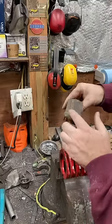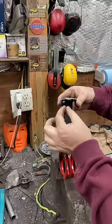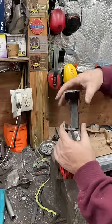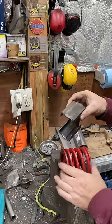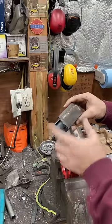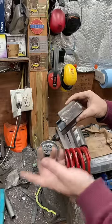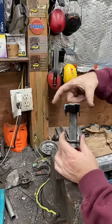There's a weld along here, along here, and along here. So when the spring is compressed, the spring is pushing outward in this direction — on both sides pushing outward. Regular steel weld can hold, I don't know, 30,000 psi in tension per square inch. So let's say there's a half square inch of weld — this can hold 15,000 pounds of tension force.